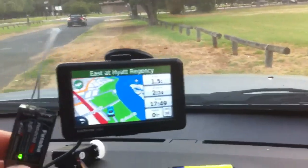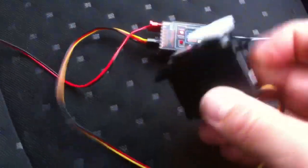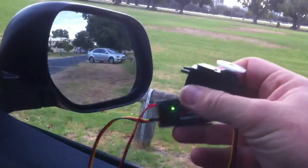Now it only works fine when it's got a clear line of sight. If I move it away, if I move it down, it'll lose its connection — and you can see the servo is in fail-safe mode on the throttle. So yes, it's just lost connection there. If I bring it up, it has much better connection obviously when it's got line of sight.